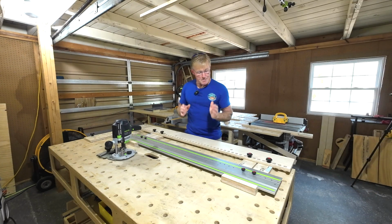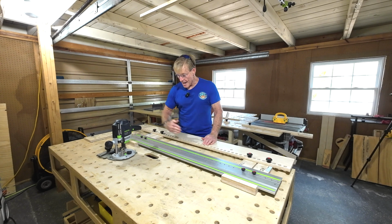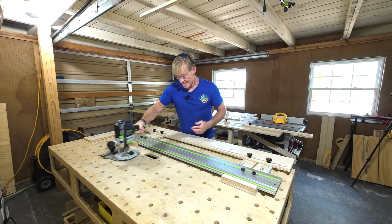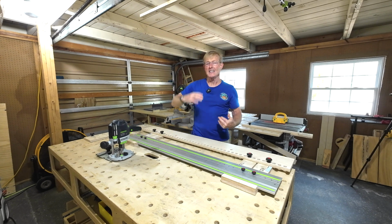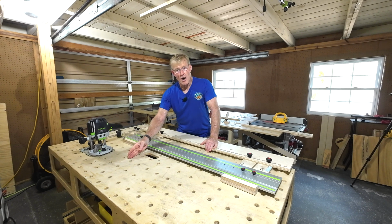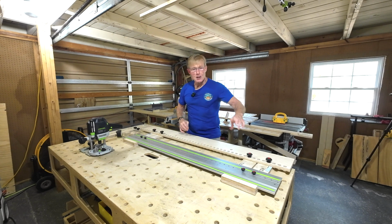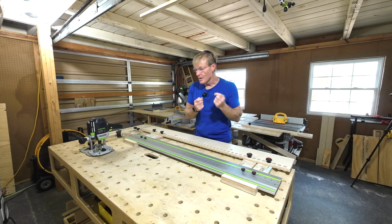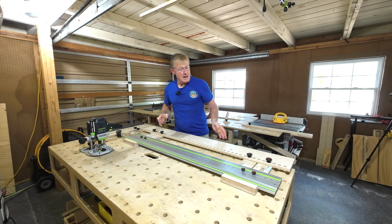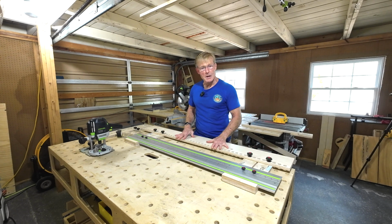The slowdown though is making that spacing between this row of holes and the row of holes that are drilled with the bit. That spacing right there. Because if you're off 1/10 of a millimeter times 10 holes, which is just about half the bench, you're already a millimeter off. So the only point I made was take your time. Don't just go off the dimensions because you almost can't see it even with the most refined measuring tool to drill that hole.